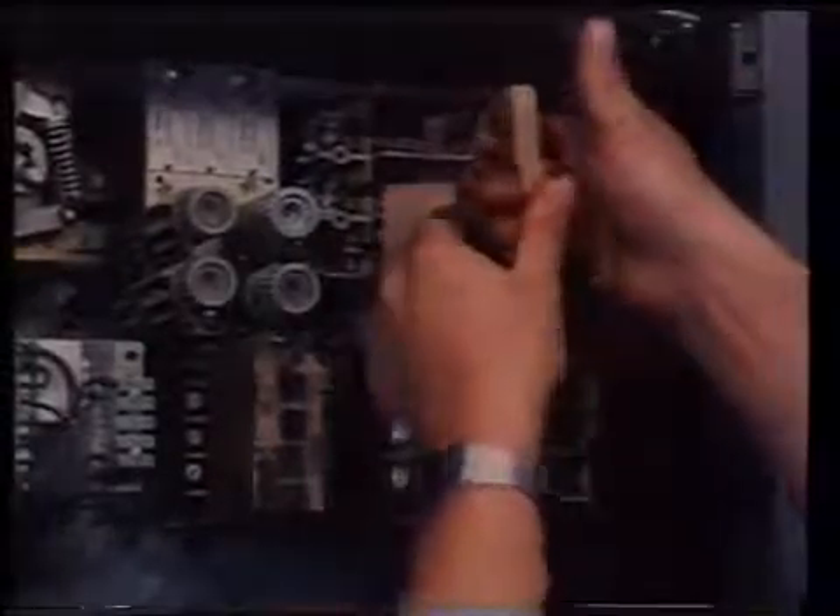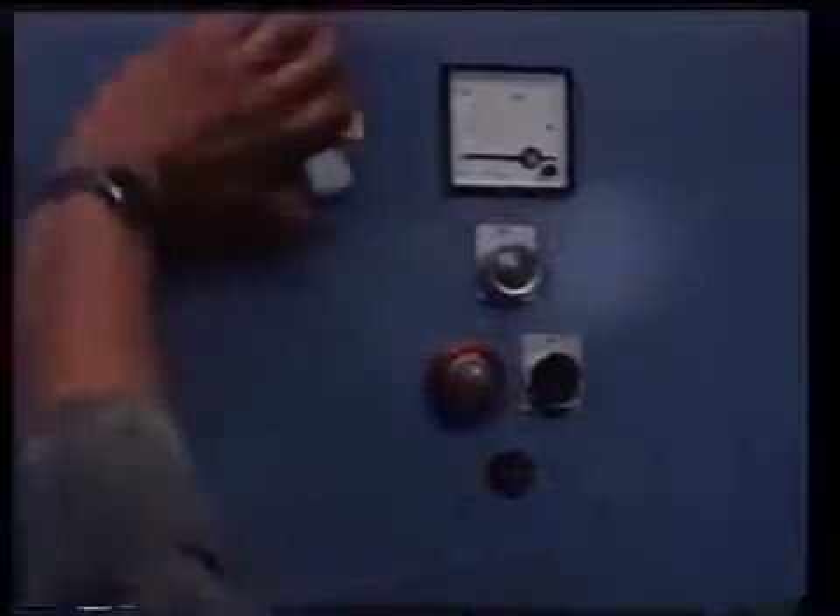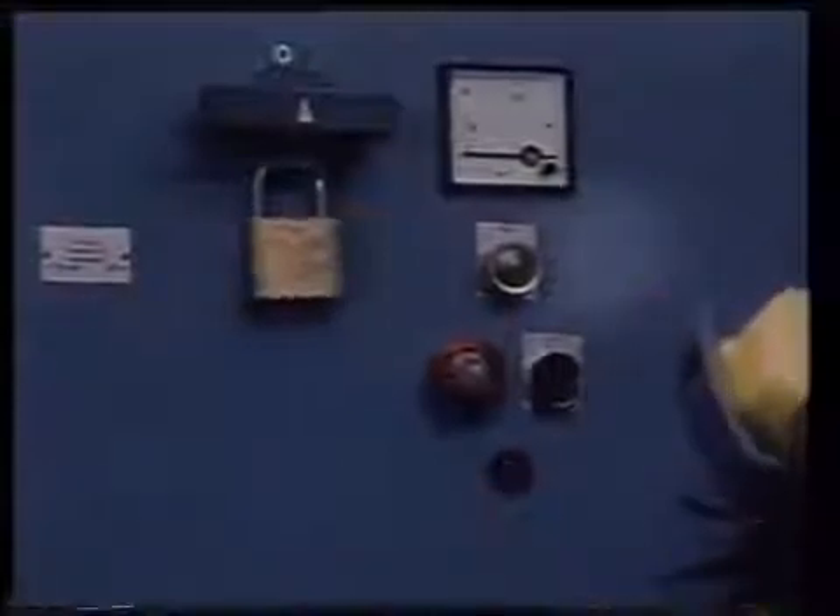Now, we must emphasize electrical safety. The golden rule is: before any work is done on an electrical installation, first isolate the circuit by removing the supply fuses or locking the circuit breaker in the open position so that the circuit cannot be energized accidentally.